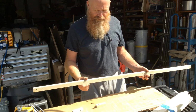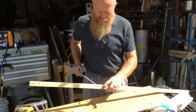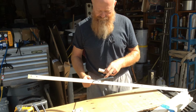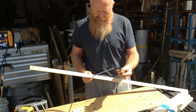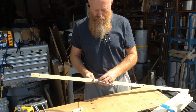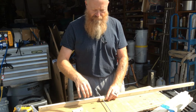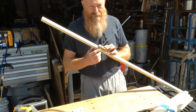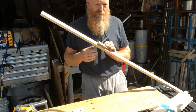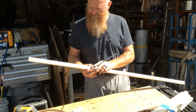And what we'll do is we'll be tying it together with 1/4 inch bolts with 1/4 inch pegs in here, and then I'm putting spacers in between each board, so when I tie them together it'll give a slot for the dirt to come through. It's recut on here, so if any water gets down into it, it'll actually pour through. But we'll glue all this up together and get it built and show you what it looks like.